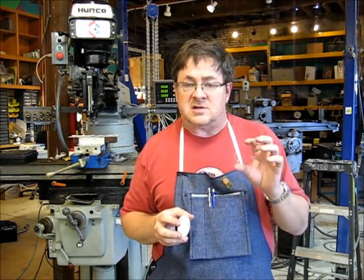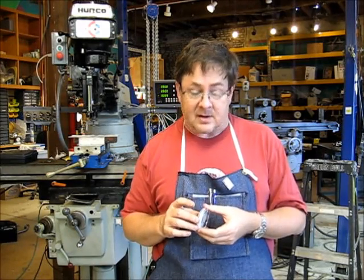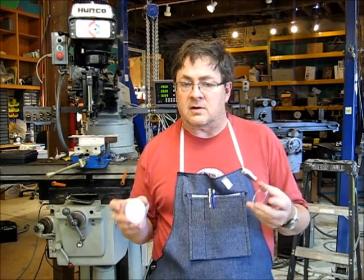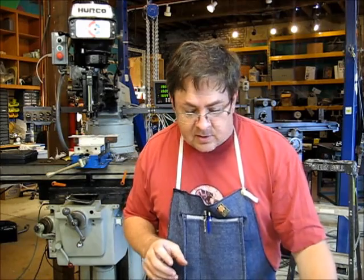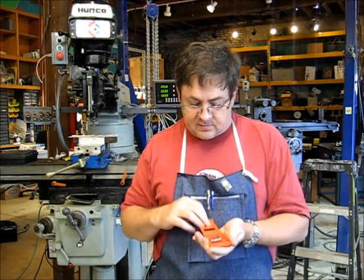I've cut 6-inch stainless steel disc, got a 3/16 with that stuff, not thick, but I've cut stainless, cuts fine. I've cut cold roll, cuts fine. Cut aluminum, cuts fine. The drag cut cutters, the drag cut geometry is pretty amazing.